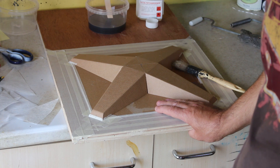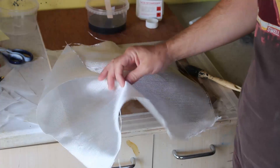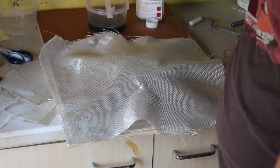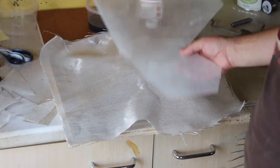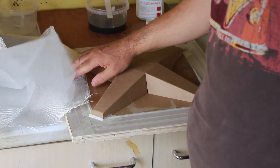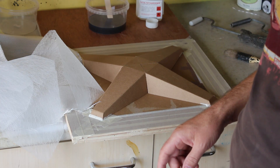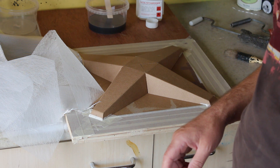The fiberglass I'm going to use is a fiberglass cloth — it's quite a lightweight cloth, 180 grams per square meter. I'm actually going to use two layers of this cloth, but cloth doesn't like to be put straight on top of cloth. Normally you'd use a chop strand mat in between each layer, but because I've run out of chop strand mat I'm going to use a tissue layer in between. When you use cloth and tissue you only need the same weight of material as resin, whereas with chop strand mat it's two and a half times the volume of resin to the weight of the mat.